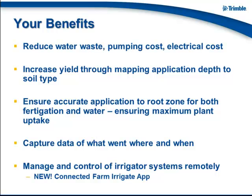The biggest benefit to you as a customer is reducing water waste. If you have zones in the field that might not require as much water as another zone, we can achieve that. If you have an exclusion zone or a road going out to the center point that causes mud issues when you traverse it to refill a chemigation tank, we can apply section control to shut off those valves as the irrigator crosses that road. All of this in return can help reduce pumping costs or electrical costs. We can also take advantage of SIS mapping — running soil information systems across your fields, bringing in electromagnetic solutions, and mapping out water holding capacities and different soil types.